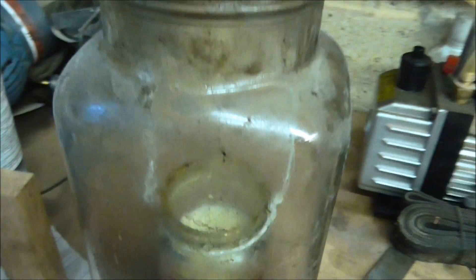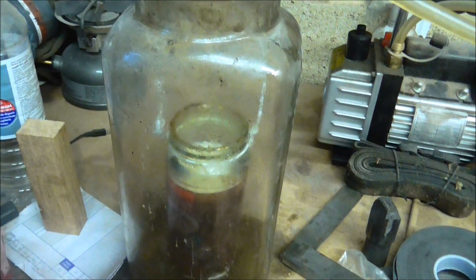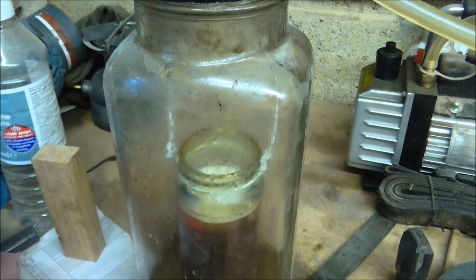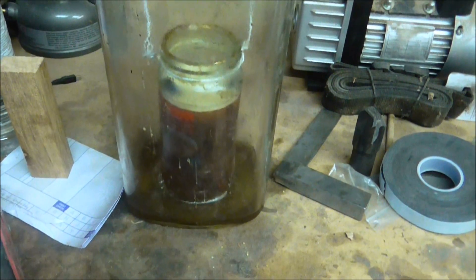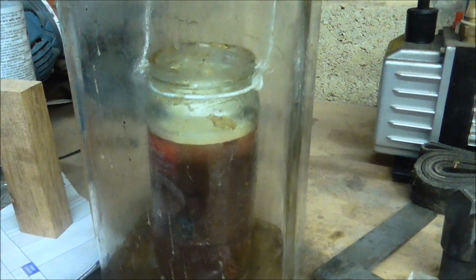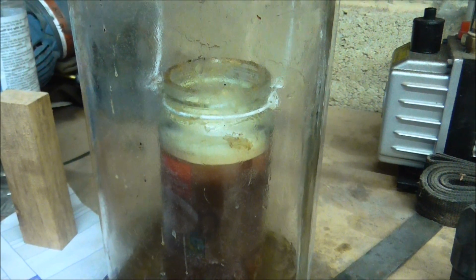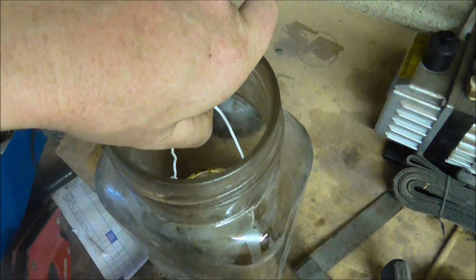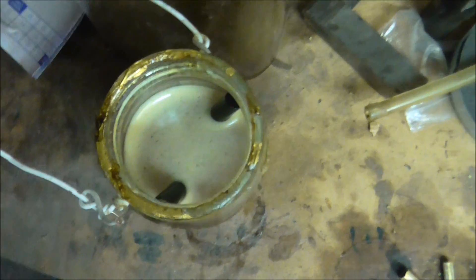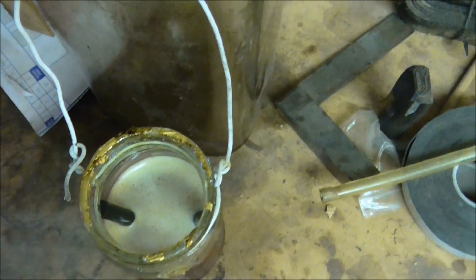Some of you are probably wondering about this vacuum — it's quite a strong vacuum, and there's an awful lot of atmospheric pressure working on that jar, it's quite dangerous. You can see that now, the jar's cleared and all the air has been sucked out of the wood. I've removed the vacuum, and my fire steels are in there now. I'll just leave them in there for two or three hours and let them draw some of the oil into the wood.